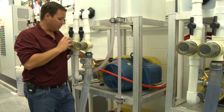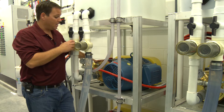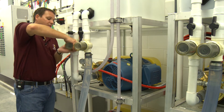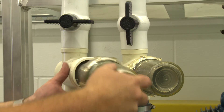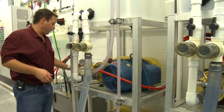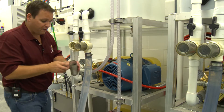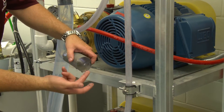If you're using a good clean quality source of fresh water, this may never need to be done. To clean out this filter, you simply turn off the ball valve. If you don't turn off the ball valve first, you're going to get a shower. Then when you pull this off, there's still going to be a little bit of water that comes out, so you're not going to want to get too close to it. When you pull this off, we're going to see that this particular filter is doing its job — you can see all the little trash that's caught inside the filter.